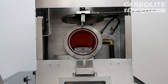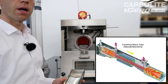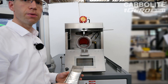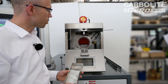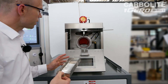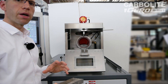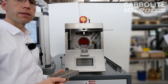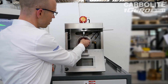The sample for this particular customer is a tube used in satellites — a high-frequency tube which is heat-treated in this furnace. But it can be many other samples; annealing under hydrogen is an application used for various samples. This furnace has its advantage when you have a small batch production. For batch production, for projects, for customized heat treatments, this is the perfect solution because you can immediately have different atmospheres and your heat treatment is very easy and simple.